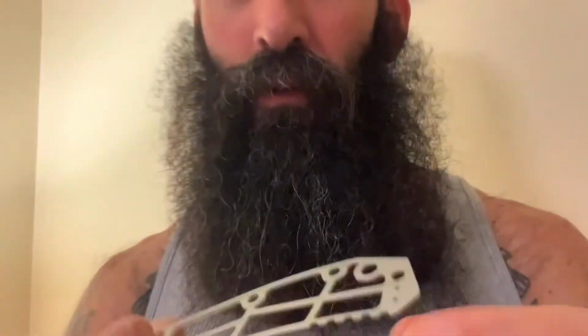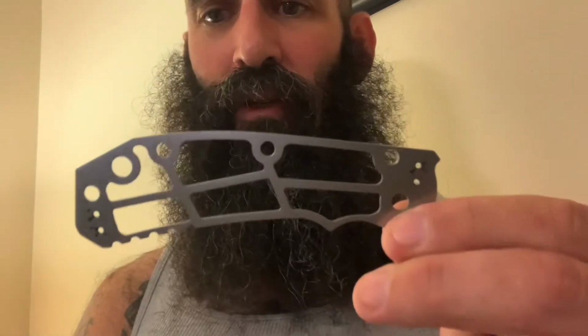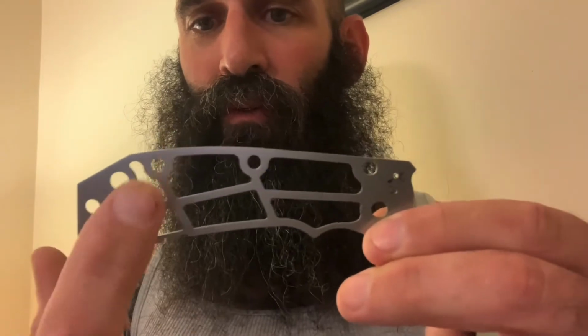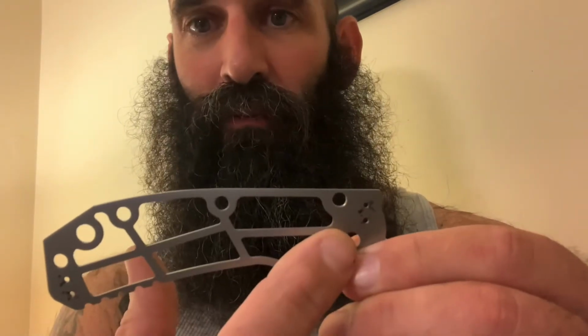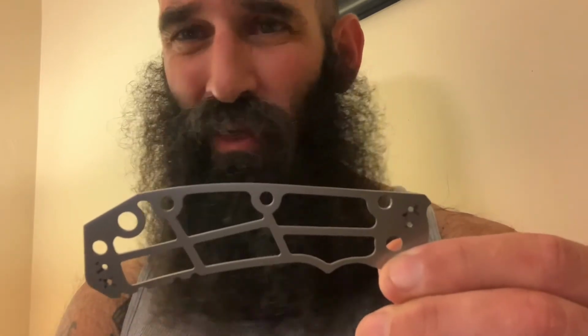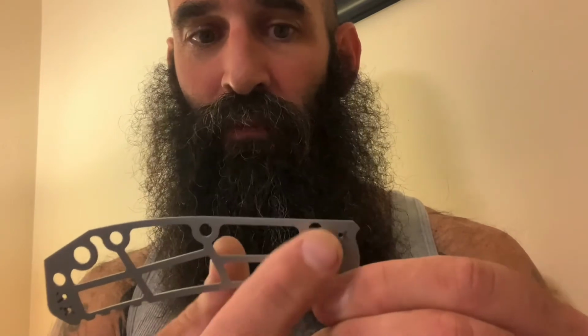Once I was at that point, it's just a rectangle laying in the vise. I did the backside, and let's do it where you guys can see it. Oh yeah, there we go. So it's going to have this hole, this hole, this hole. This is a blind hole because that's for your stop pin, and this hole. So obviously I found the size of the holes, and I don't need to see them for that, as you gauge pins. So this is a 218 hole. That's a 1/8 or 3/16, 187.5. Same with all these other 3.